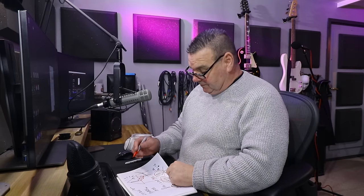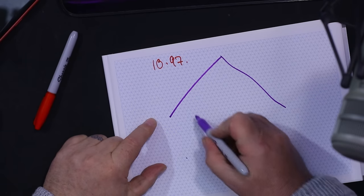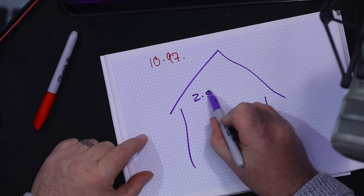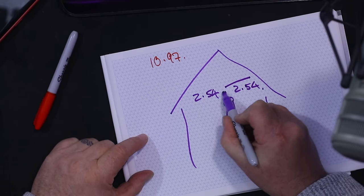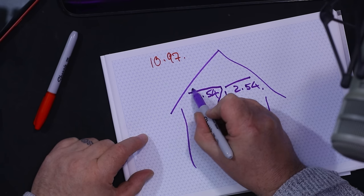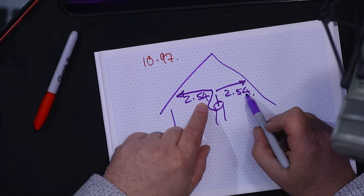So we've got the vertical covered. What else could we do? We agreed the wavelength is nearly 11 meters — about 10.97. You could just put up a dipole. The quarter-wave length we agreed was around 2.54 meters, so you'd have 2.54 meters one way and 2.54 meters the other way across the loft, with the coax in the middle — giving you two dipole legs going in opposite directions. It doesn't matter if one leg is 2.56 and the other is 2.52; slightly off-center won't matter.